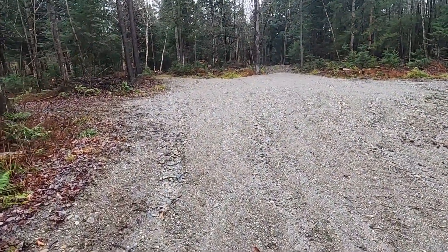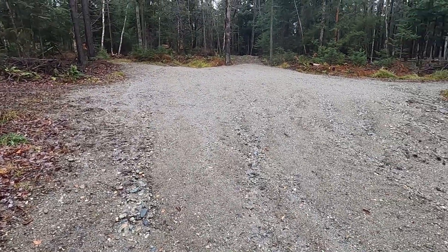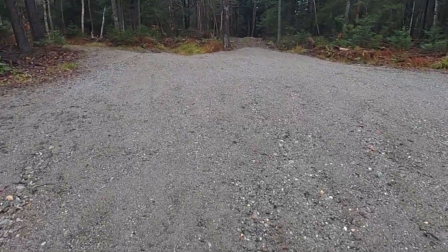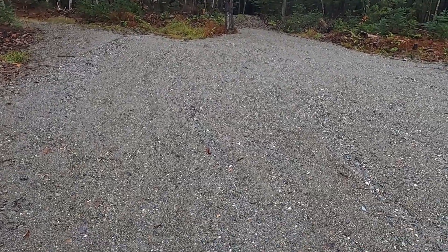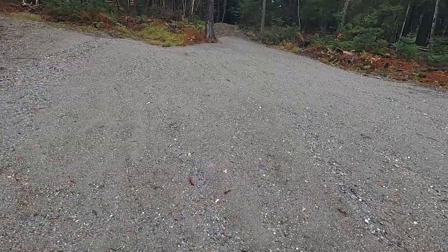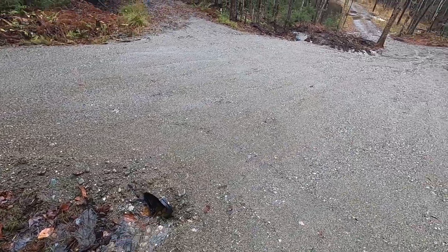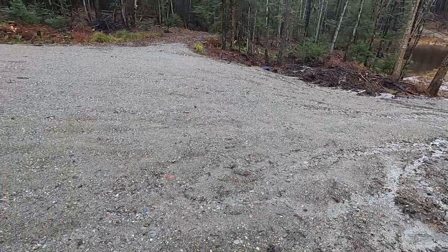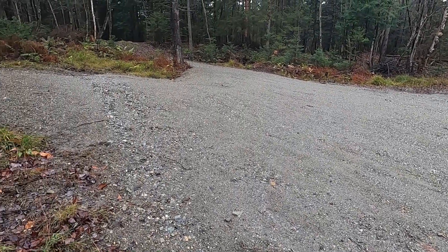This area is one of my more challenging areas and I'm not sure I'm completely done with it yet, although right now it looks pretty good. I call this 'five corners' because five roads meet here. There's a lot of runoff and no good way to push it off to the left or right. My only option was to drain it through the intersection. The other issue I faced was bedrock. So I have an eight-inch culvert — ended up being 40 feet of culvert — going down through the intersection. It's rather shallow, so I covered it with a lot of gravel. It makes a bit of a hump in the middle.